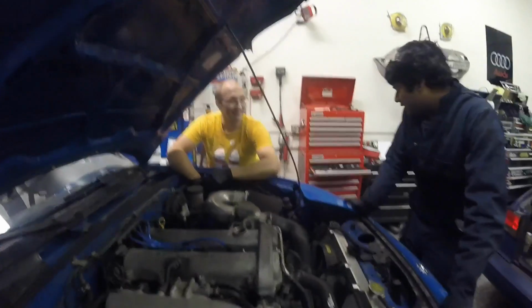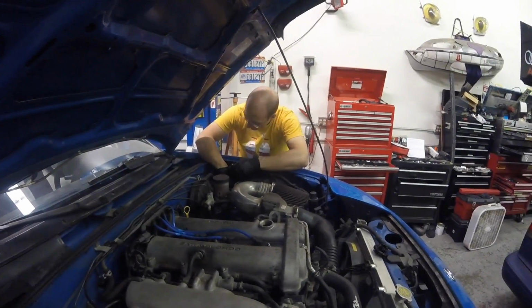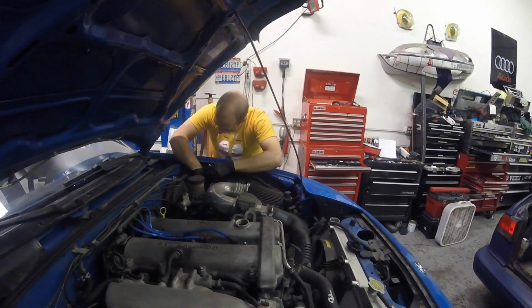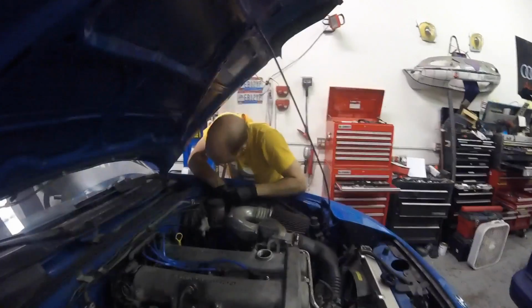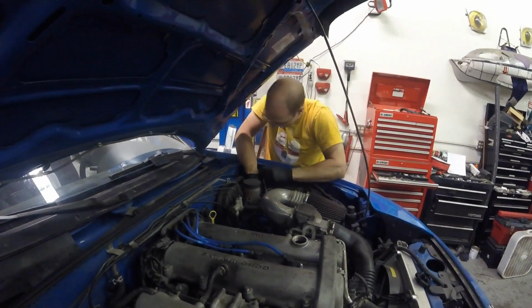Is there a torque spec on this? Tight. Tight, yeah. It's a bolt to the firewall. I can't see it. It's an M8 by 1.25. So I guess like 25 pound-feet. Yeah, that's tight. That's not coming off, put it that way. The canonical torque spec for that bolt is 18 foot-pounds, unless otherwise specified.